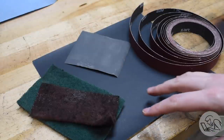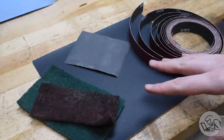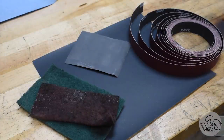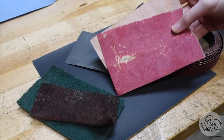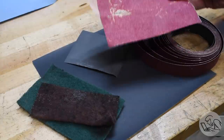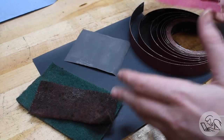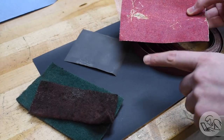I'm going to talk about emery paper. What is this stuff? How do you buy it? How do you use it? It's a very interesting topic for hobbyists especially because we have low budget equipment. Emery paper or emery cloth is kind of a catch-all term these days that refers to a whole family of abrasives that we use in the machine shop. If you're coming from a woodworker or DIY background then you're probably thinking of sandpaper — you have ratty old sheets of this stuff in drawers everywhere. So how is this different than emery paper and emery cloth that we talk about in the machine shop? Well, not that different as it turns out.